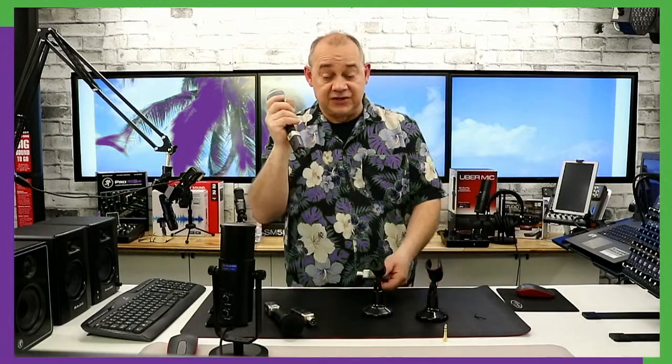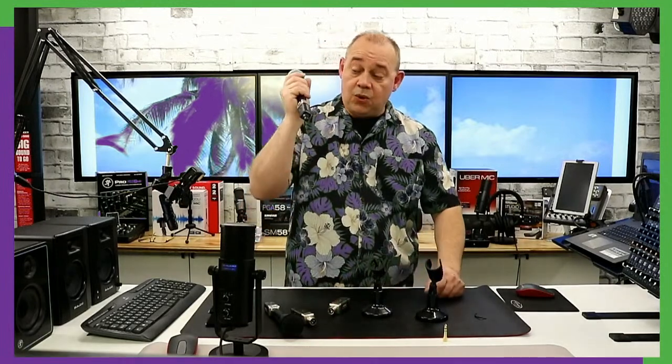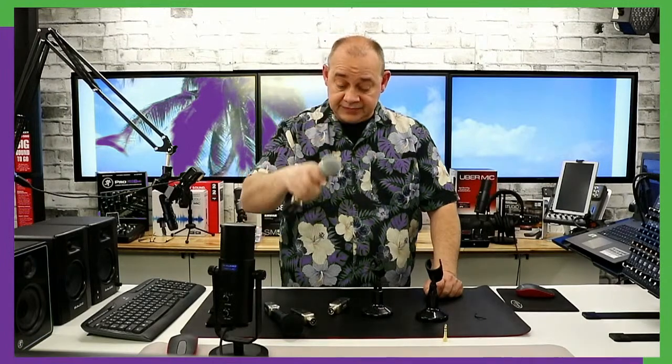So again, if you're holding the microphone like this, you will get yourself 75 feet from the actual mixing board. So if you've plugged this into your mixing board, 75 feet line of sight. I've tested this around the corner from the mixing board, down a hallway, just stepped outside some doors. I was at almost 75 feet, and then in the parking lot it would cut out. That's a long trip to go before your microphone cuts out. So if you're inside an auditorium or a gymnasium, or if you're in a hall or a church, these tend to work out really well as long as you've got line of sight to the other end of the room. And that is your Xvive.